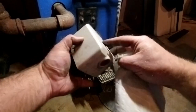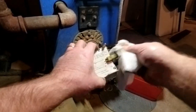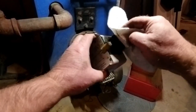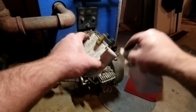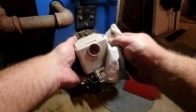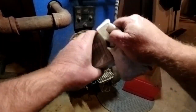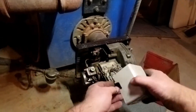So in Riello, this is the ignition transformer, the primary control, and the CAD cell, all in one control. If you've never worked on one, they're totally different than our standard burners made in the United States. They're Canadian built. I think some came from Italy too. I don't know if they still do that. Like I said, I don't really get involved with them too much. But I've worked on many of them throughout the years.